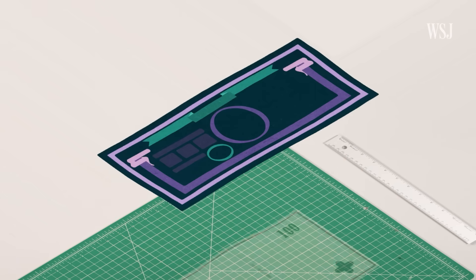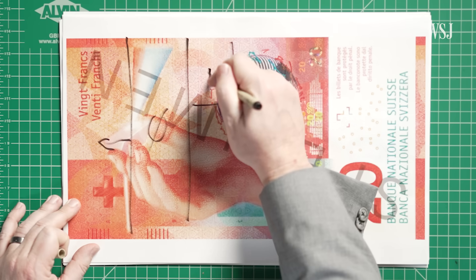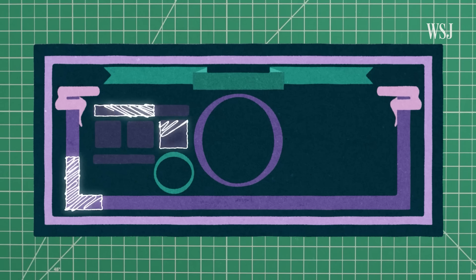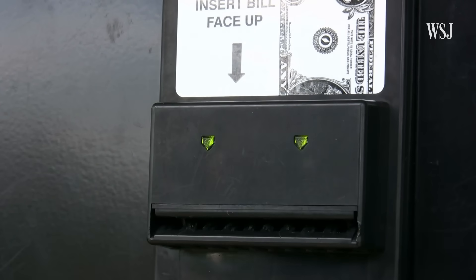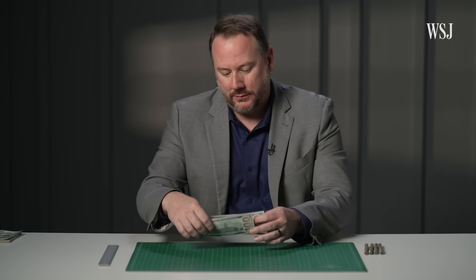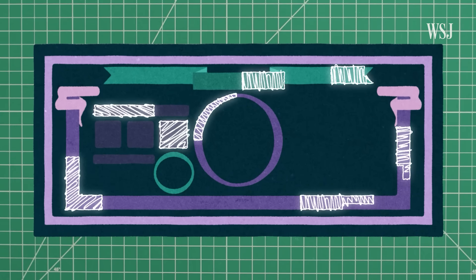That's where level 2 security comes in, designed to stop advanced counterfeiters spoofing machines. These are typically things like magnetics. There are two types of ink that are used: magnetic ink and non-magnetic ink. These inks are dispersed through the note and create a pattern that a magnetic sensor can read. And to help keep things secure, central banks don't always tell manufacturers of note scanners what they're actually supposed to be looking for. But even at level 2, counterfeiters are able to cheat the system — the machine's only looking for one specific thing, and if you trick that one specific thing, in this case magnetics, that's all you need. It can literally be blank paper that tricks a sensor.